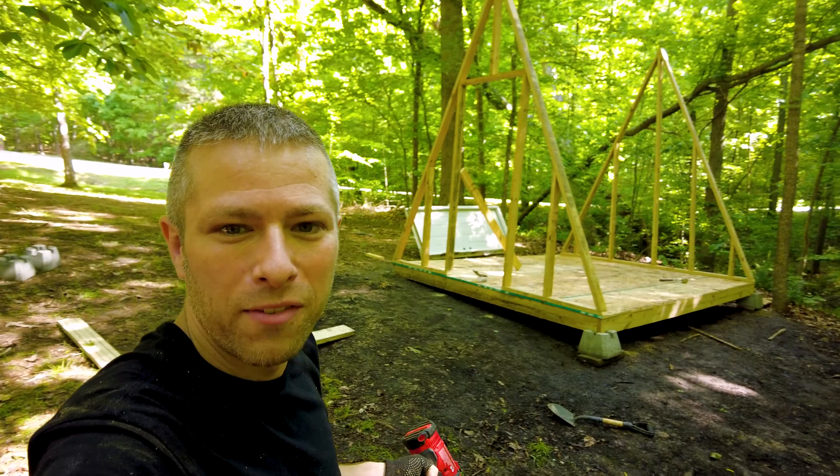I've got the ribs built into the tiny house. This beam will hold things in place while I get everything situated up top. I'm up on top of the tiny house and I've almost secured the beam into place. The way I did this all by myself: you can see my feet — I'm crawling around on the siding. This 2x4 I attached to the rib cage allows me to walk around up here. I put these little blocks up here to hold the beam into place, and while it was held I could go through and screw everything on.